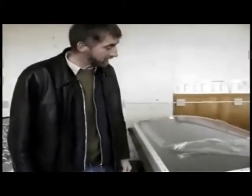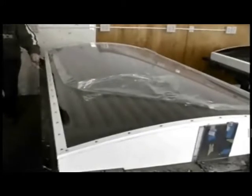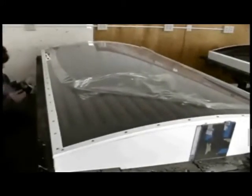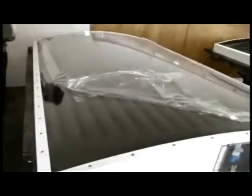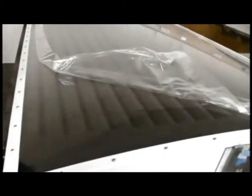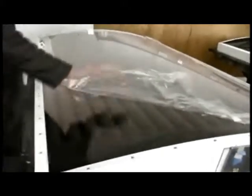The panel is basically made out of powder-coated galvalume and UV-stabilized polycarbonate, which is the lens area. The sun shines through this clear lens and hits the black aluminum. We have 240 pop cans modified to cause the air to spin through them, and centrifugal force separates the relatively heavier, colder air out of the rising column. The air is pumped in from the house into the bottom header, goes up through the core, and then back into the house again.